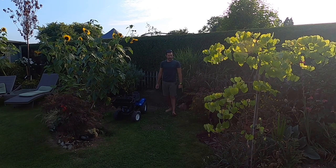This is a pond where I don't want to see any pond liner at all. Usually I would start stonework and rockwork from perhaps 12 inches below water level. Some of the marginal shelves will be a little bit deeper, but the base of the pond will always be bare liner. This one I want to make more of a formal feature than a pond. And I think there will be fish. My kids won't let me get away without adding any fish, but for me, the joy of this is going to be the wildlife it attracts, the sound of the water, the reflections, the movement.